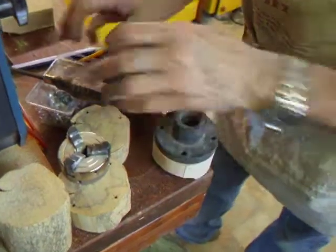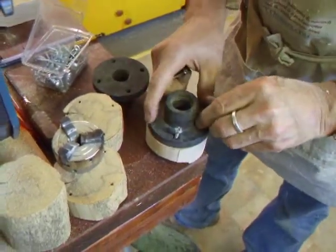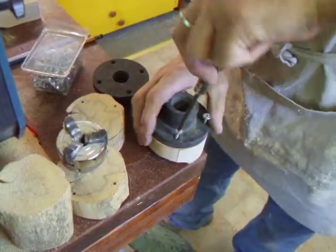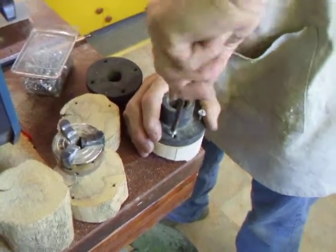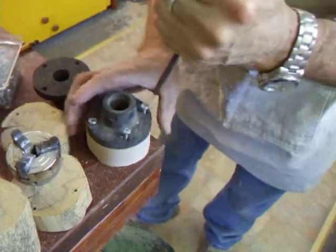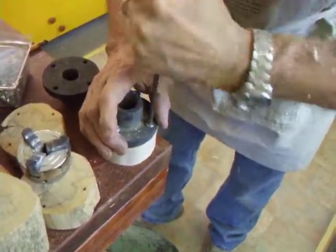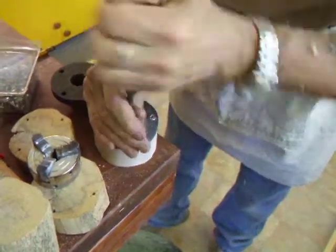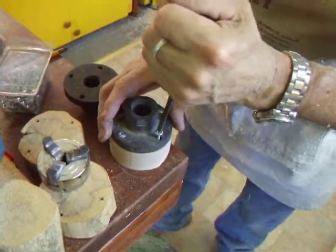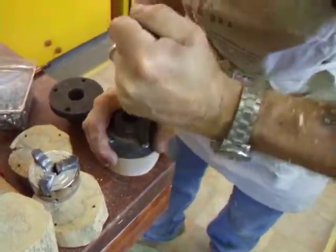Then let's get the screws out and we'll fit it on. And it needs to be nice and strong, but not so strong that you can't screw the screws in, obviously. That's what the clearance holes are for. Do opposite screws, just like doing a crankcase. There we are. Let's screw that up. Check they're all nice and tight.